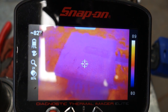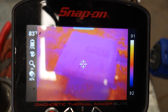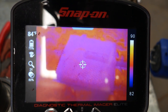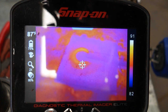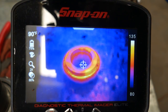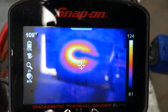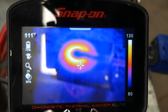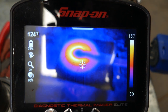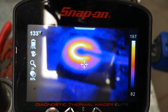In the manual, it says the Mini Ductor shouldn't be run for more than about 15 or 20 seconds at a time. This will require a little more time than that, so if it shuts off you might have to recycle it, but I've never had an issue with it shutting down or overheating. I'm now pulling the trigger and we're going to see it start heating up. We can see that inductive ring heating up, and the bearing is warming up. It does look like we're getting a little bit of heat built up on the bearing cage, but from my experience doing several of these, I haven't had an issue. I want to keep checking it because I don't want to heat that bearing much over 200 degrees. The pad will probably get hotter than that — normally I see about 220–230 by the time the bearing gets up to that 200-degree temperature.